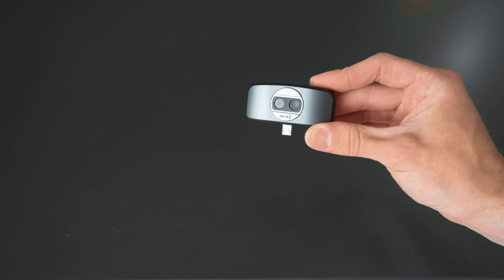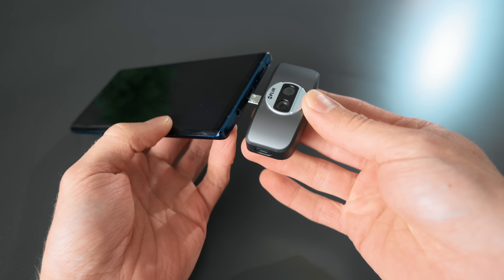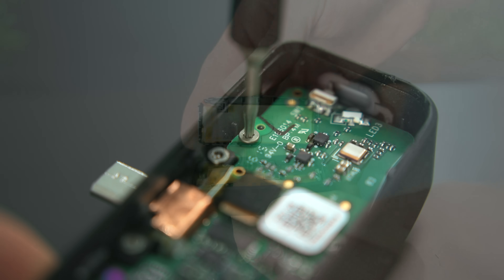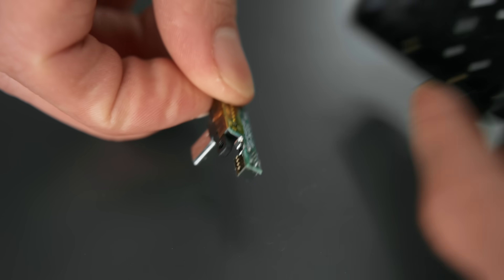Now this little mod is not just limited to converting things for laptops like USB receivers, but you can actually use it for a variety of different devices too. For example, I've got this FLIR ONE thermal camera, and it's actually intended to be plugged into smartphones. However, it was made a few years ago and still uses the older Micro-B connector, so unfortunately I can't plug it into my newer phone without another silly dongle. So in an effort to get at the USB connector, I can simply prise off the back and unscrew the board to lift it out. Interestingly, the USB connector board is completely separate, which does make my job a bit easier.